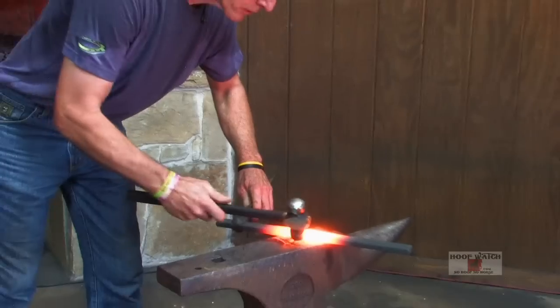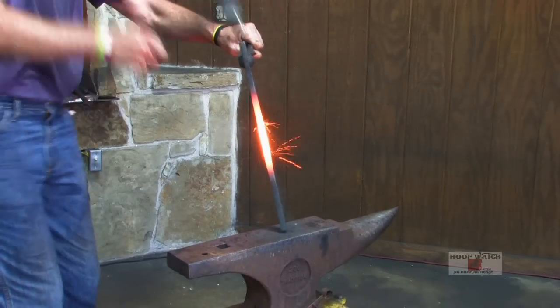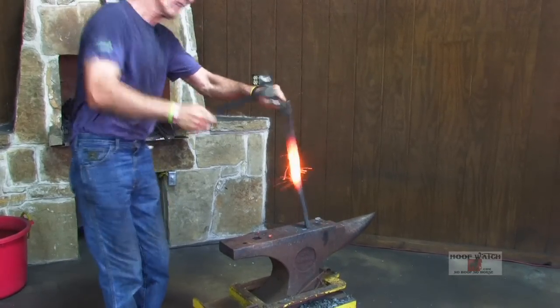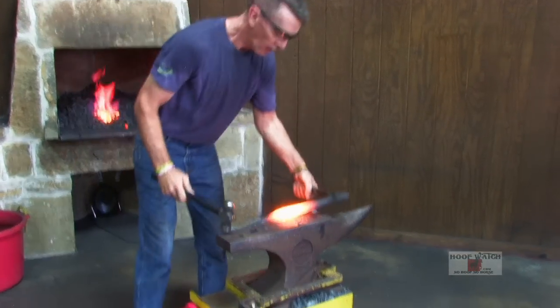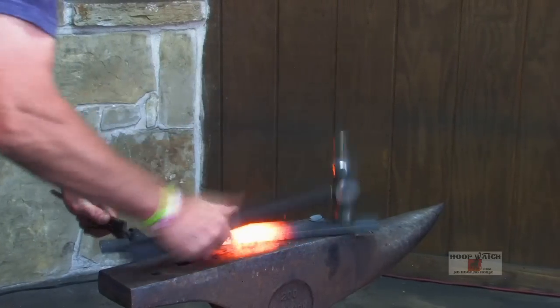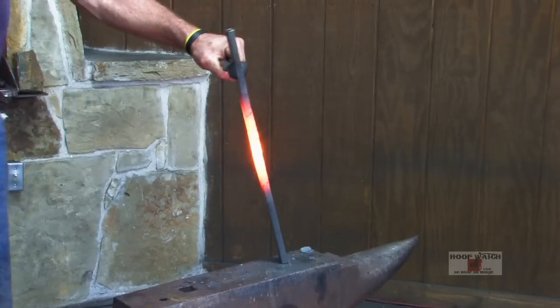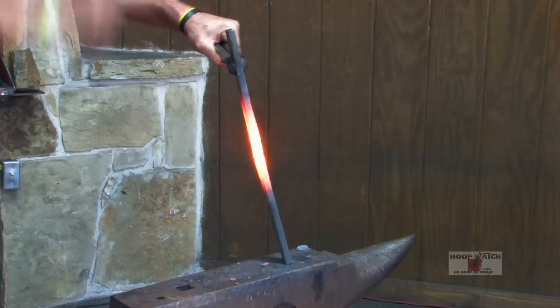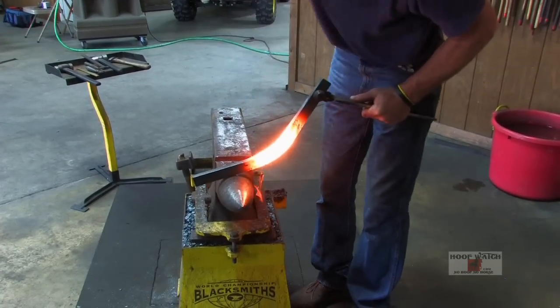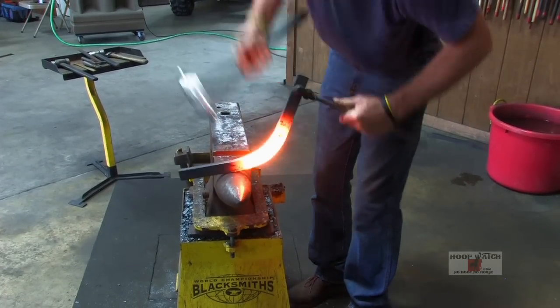All right, center punch marks right here. I'm gonna lean back and go straight through the stock and leave it rather limp on the anvil. Most of your distortion comes in the branch from too tight on your tong hand. Work out here on the perimeter because it's already gonna bend in the toe a lot more and skip over to this side.